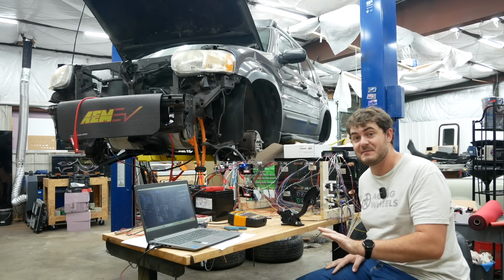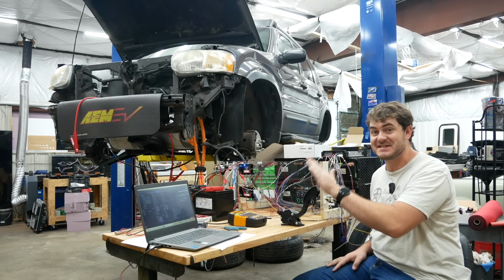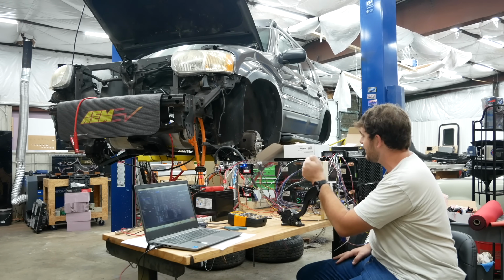That's all I'm going to do at the moment. There's no coolant running through the inverter. There's no gearbox oil in there. I risk damage if I do anything more than just that little simple thing. In fact, I'm going to put it back into park.